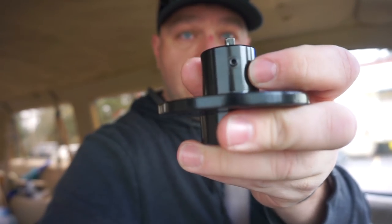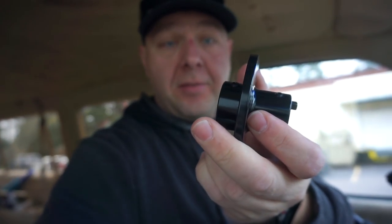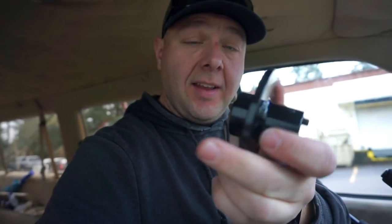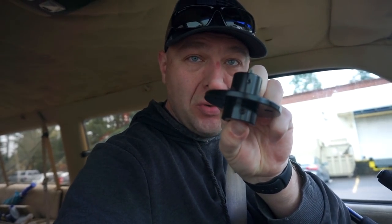We have our parts. What they wound up doing was drilling and tapping the hubs and installing some set screws — you can see one small one here and one bigger one here. When it slides onto the motor shaft, this removes any slop or play. That was the previous issue — these went on the motor shafts and weren't tight, and after banging on them for hundreds of miles everything wears out. These little screws are gonna keep that from happening.